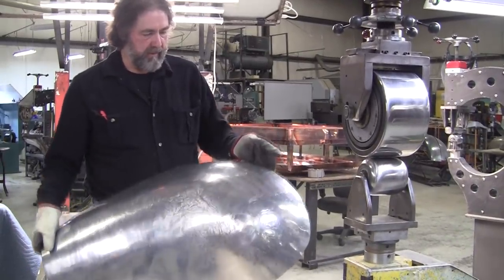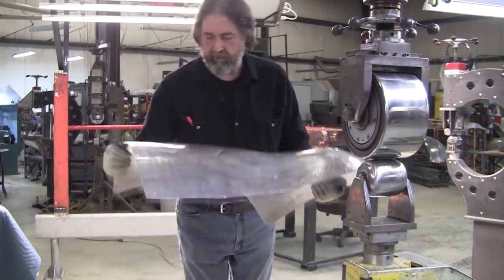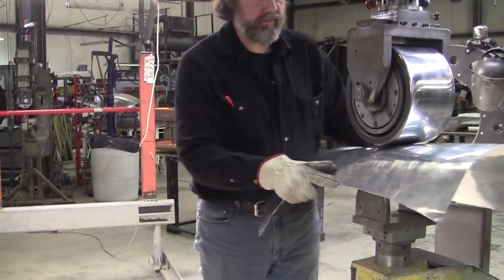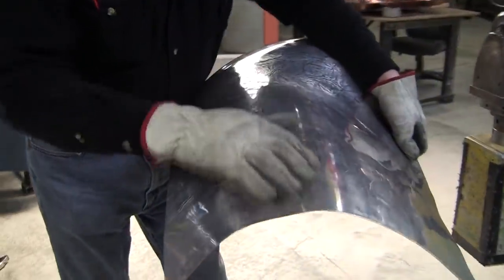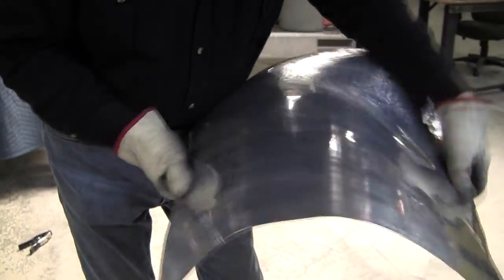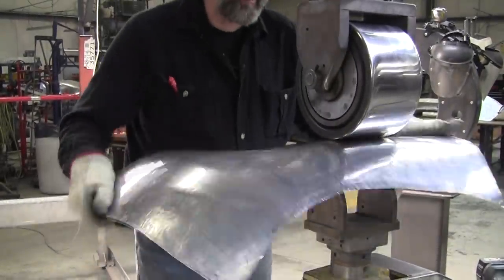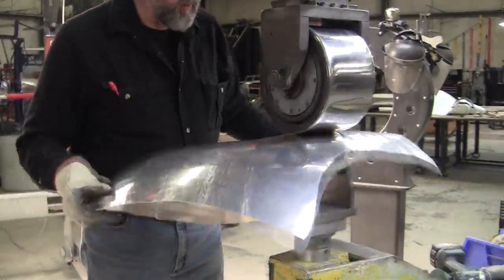And then you have a situation where you might be going over a high crown, like, well, this is a strong radius. It's not really a high crown right there, but if I go on that one like this, then I'm going to get what's called a bottom wheel bite. The bottom wheel bite doesn't look as bad. The residue of the top wheel bite is a little scratch-like, but it goes out. The bottom wheel bite, you'll see on both sides. And again, you have to turn it either at an angle or 90 degrees to get rid of that. So you have to be on guard for that problem all the time.